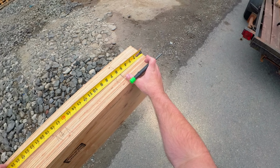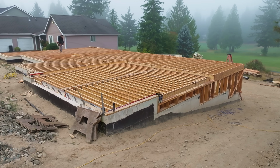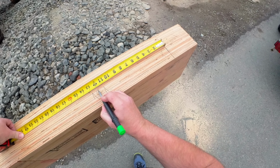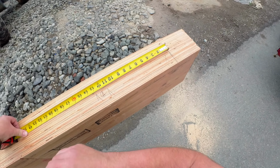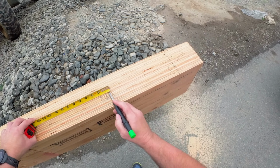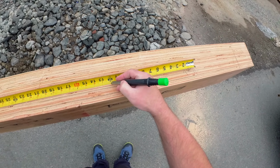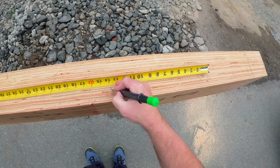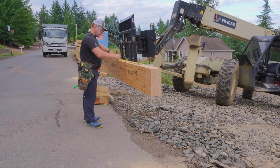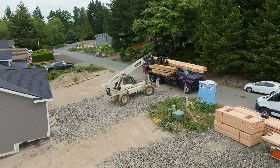Okay, I have a 5.5 inch wall that is standard height. My garage is lower. I want my layout to start from butting that taller wall. I'm gonna have a joist there and I want my sheathing to break at the center. Center of my joist is at 1 foot and then 2 foot, 3 foot, 4 foot. Plus 7/8, minus 7/8 because it's 1¾ inches wide. And that way, center of joist is consistent. Now I'm just gonna mark every foot plus 1¾ inches. So 2 foot, 2 foot 1¾, 3 foot, 3 foot 1¾, 4 foot, 4 foot 1¾.